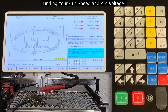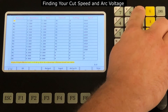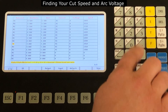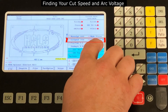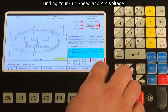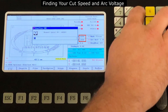Now we are going to prepare to run a manual test cut. We will start by choosing some start point settings from the cut parameters chart, which can be accessed by pressing number 9 on the keypad. You can scroll down to your material type and thickness, then press F1 to load those values onto your home screen. When performing a manual cut, we will need to disable the THC by pressing number 8, then adjust the manual traverse speed by pressing the X button and matching the value to the program cut speed.